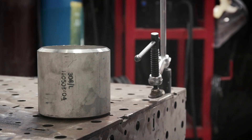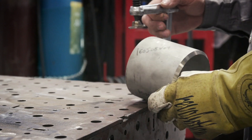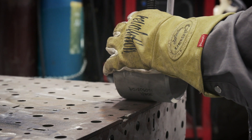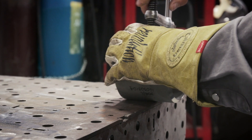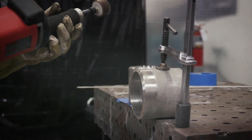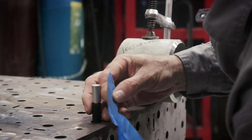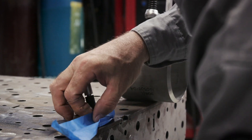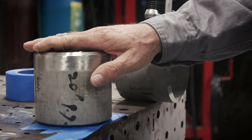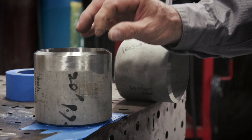We're going to set up the coupon in this tab and slot table - fortunately I have one, not everybody does. I'll take the angle grinder, slap the inside, slap the outside, and shine up the bevel for a nice knife-edge bevel. Then I'll take my diffuser, slide it up through the hole of the table and secure it. I'll set the coupon on top of it, put my gap wire on it, put the prepped piece on top, tape the top of it, let it purge, then tack it.